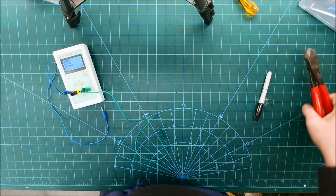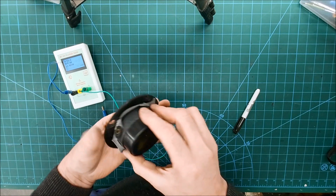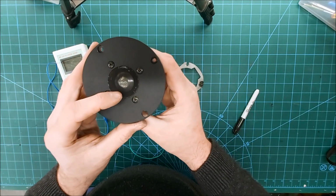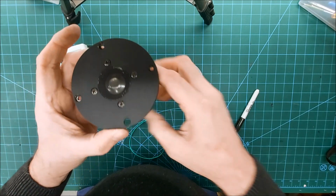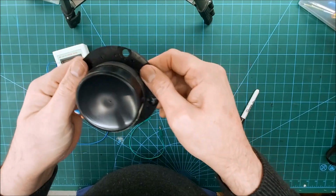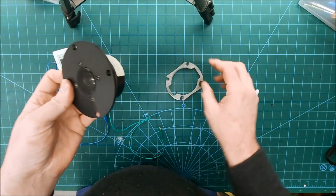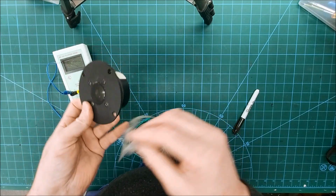Right, okay. Well, there we go. So I'm not too sure what we're going to do with these. I'm fairly sure that we can repair the mesh on this tweeter, but that's a metal dome, and once they're pushed in like that, they'll crease. They'll never be the same again. And also where the screws have been over tightened before, the plastic bezel here has blown out at the back there. You can see it's blown out there and there. So yeah, someone's really wound them up tight. So these have been out before. Probably someone's taken this out and had a go at repairing it. I don't know.